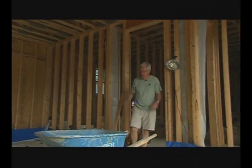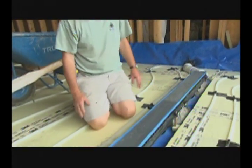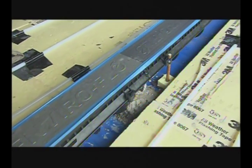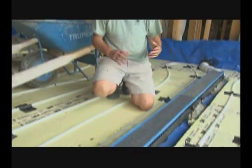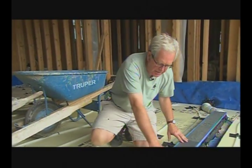We're in good shape here. All the insulation is down, the radiant floor heating tubes are in place and pressurized, and the trench drain is in place, all set to go. I added a few little pads of concrete just to firm it up, although the rebar does a nice job of supporting it anyway. Then I took our plastic covers, put those in, taped them off — and we are ready for concrete.